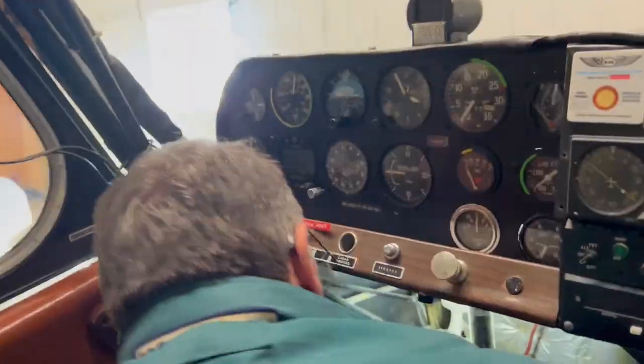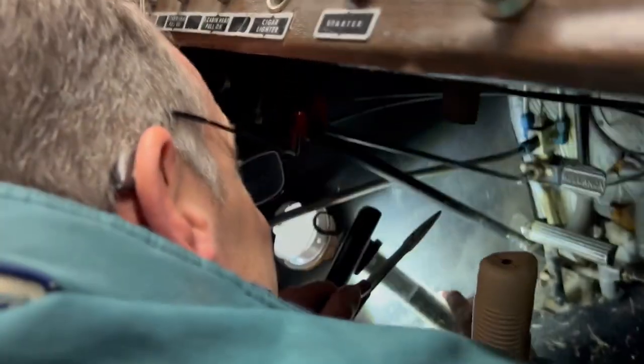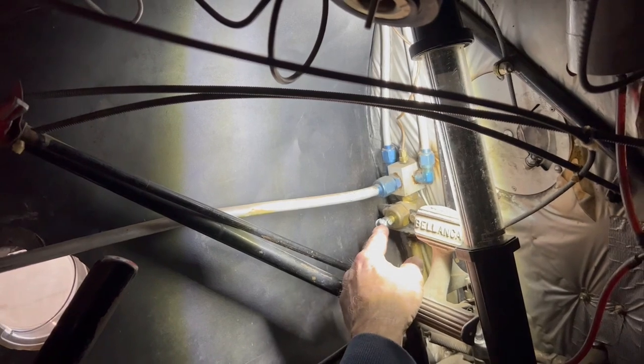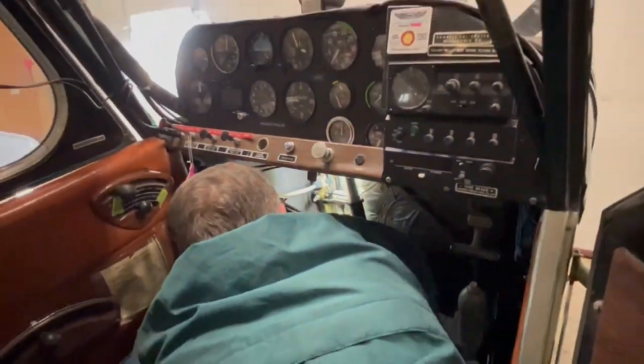I'm going to try to lubricate this fuel valve. I'm going to take this cotter pin off here and disconnect this U-joint, because I think that's a crappy angle for that. That might be causing us some of the grief. I disconnected that shaft and disconnected the shaft here. I just want to see if this turning, when it's straight, turns any freer. But I'd like to get something that I can put over that, looks like a quarter drive extension. Yeah, all right, I'll get that. It almost needs to be lubricated inside.